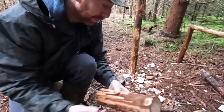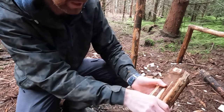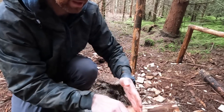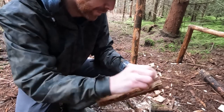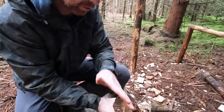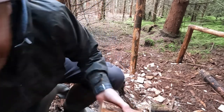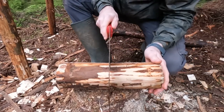What we have to do is get our handle cut out. You're going to have to gauge how long this handle is going to be — I would say around about half the length is where you want to start cutting. What we're going to do is cut out three slices, sort of almost in a triangle-type format. We don't want to go too deep. If it's not deep enough, we can always saw it again later once we start cutting off notches. But if we go too deep at the start, you're going to majorly weaken and compromise your handle. So just pick a spot roughly around halfway and start cutting.